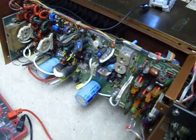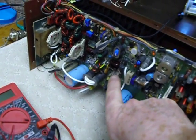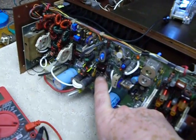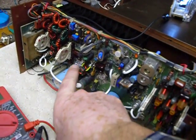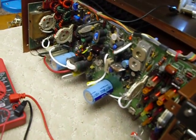I have completely tested the PA system — you saw that in the previous video. I was sure I had a good set of transistors in that first video; they were marked as matched transistors and I thought they were going to be fine, but evidently one of them had gone bad before I got this unit.